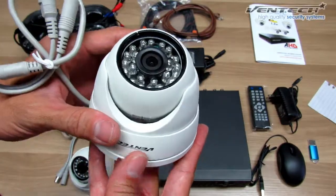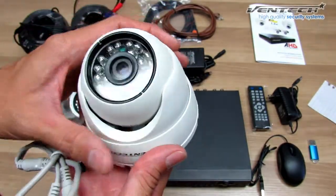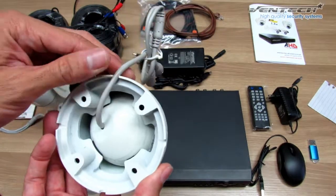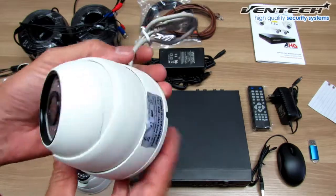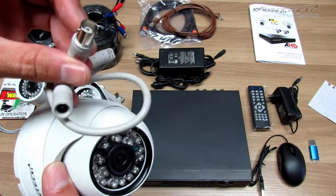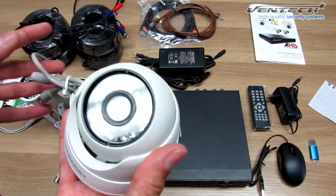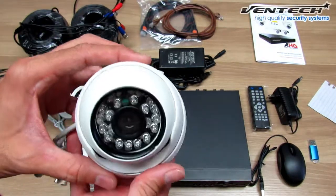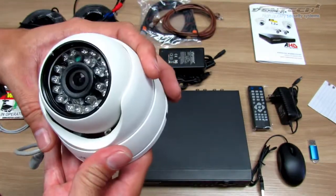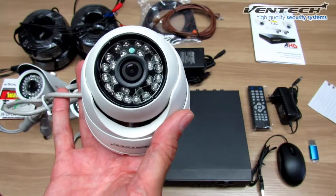You may see this one over here — it's a metallic dome camera. It has the LED here. It can work outside or inside, indoor or outdoor. This cable is just plug and play. It has the BNC connector here — you just need to plug it and twist it. And this one is the power connector. This camera has a 3.6mm lens, which is quite enough for a wide angle vision and is the best lens in the market for this type of camera.